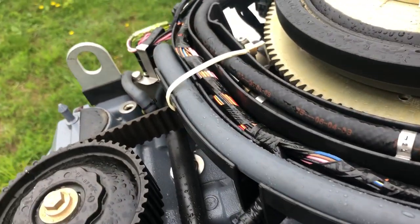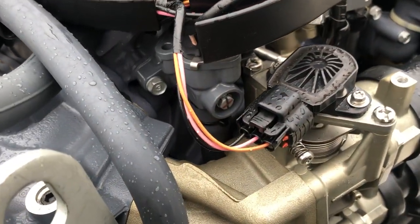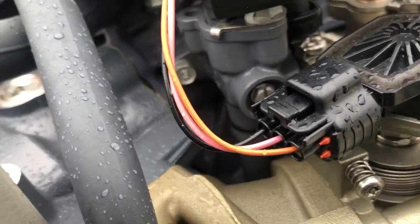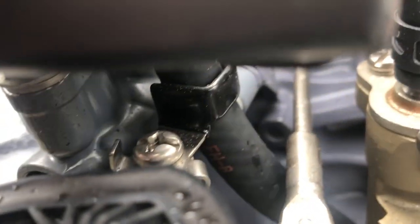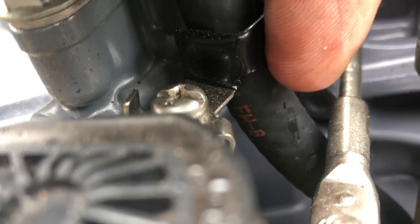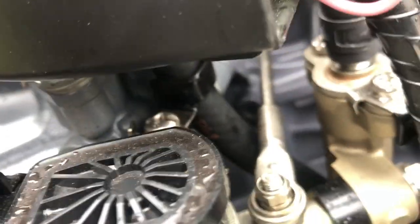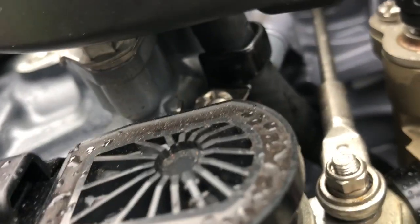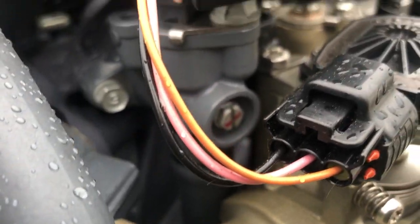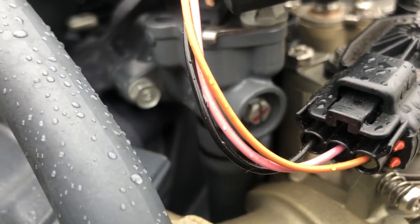Okay, so that was the port side we just did. Starboard side — I guess it's not as bad. Let me see if it's one bolt right there and the back side bolt I'm gonna need to remove. There's a clamp right there holding that hose. Once we move that hose, you can either get a swivel on it or we'll be able to get the gear wrench on it — do the same thing, pull it out, clean it up, and swap the thermostat.